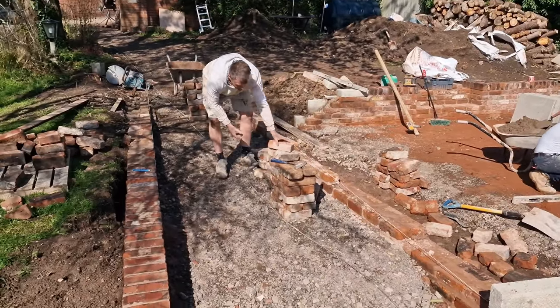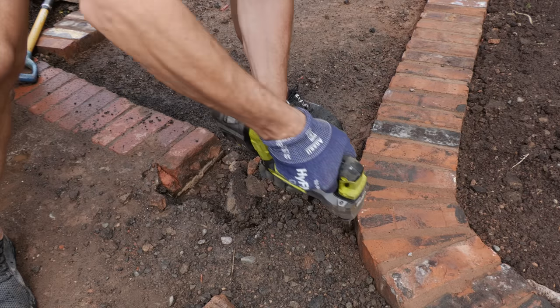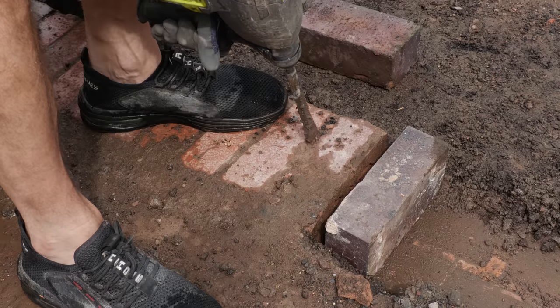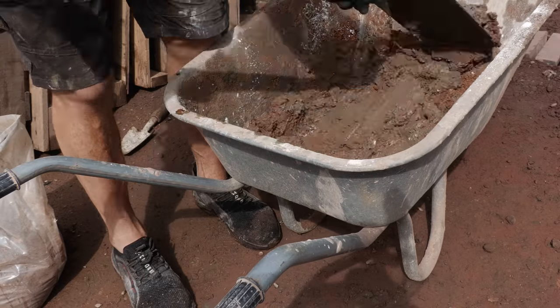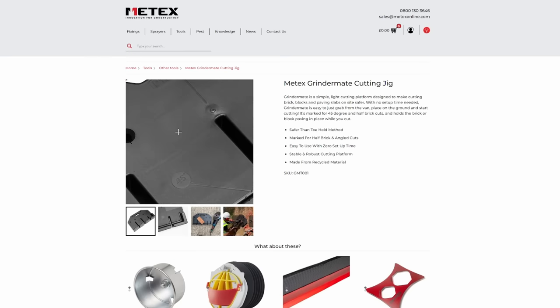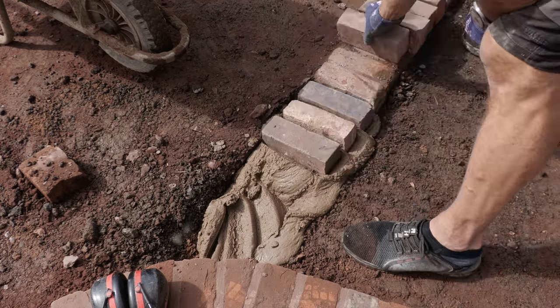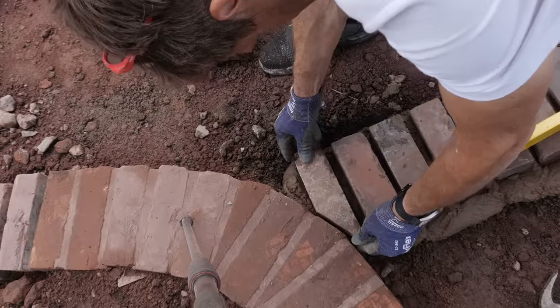This time my job was made easier because the builders had already constructed brick edging flanking both sides of the path. However, I did need to repair the broken threshold strip of bricks at the top of the path. I excavated to the course below what had been pulverized by the diggers — an 18-volt SDS drill in chisel mode is a fantastic tool for this. I then made up a mix of builder's sand and cement, about five-to-one with some sharp sand, and cut spare bricks using a grinder-mate cutting jig that Metex gifted me to try out. I set these in the sand-and-cement mix with plasticizer added.